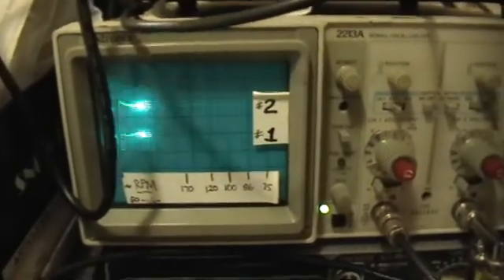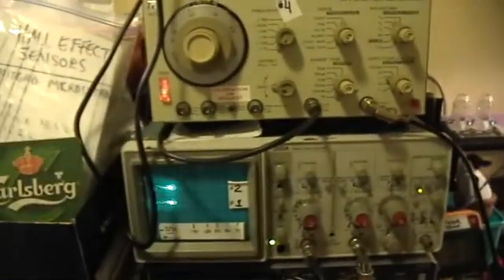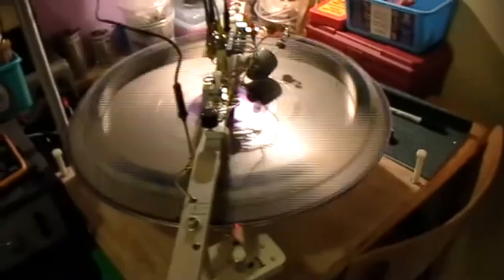We're up to about 110 RPM now, still accelerating. This four-kilogram disc on these bearings, with the keepers on all the magnets, will take over eight minutes to come to a stop from 170 RPM. So that's with no possible power input and as little drag as possible. Don't be fooled by long rundown times from speeds like 170 RPM — people that say two minutes are simply underestimating, because a heavy disc on good bearings can spin a long time.